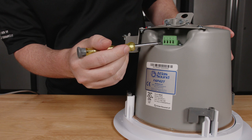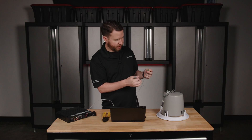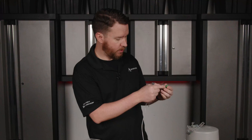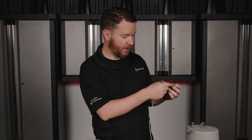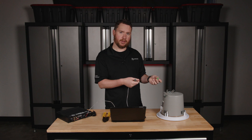The speaker also has a Euroblock connector. I'm going to remove that connector and check the polarity — polarity meaning positive or negative. On these Euroblock connectors, you want to double check that you're hooking up to the correct terminal. Some speaker manufacturers do positive, negative, positive, negative. Some do positive, negative, negative, positive. You want to select a pair of these because they are generally wired in parallel.